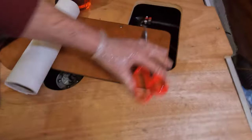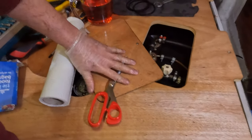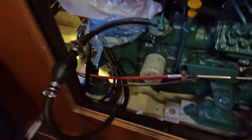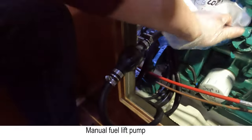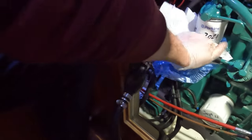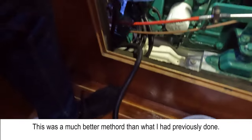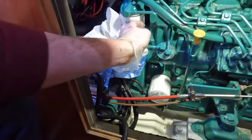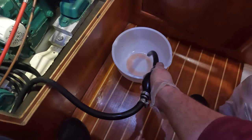I'm just going to turn the tank back on. My friend said the best thing to do with a fuel filter change is with your inline filter — if you take the hose off here and add one of these bulbs in place, you should be able to get the fuel all the way up to that point. So I'm going to prime the inline filters first, then take this off and prime from here. This one is now full to the top. I'm not sure how many pumps I'm going to need — I feel like I can feel some kind of pressure now.